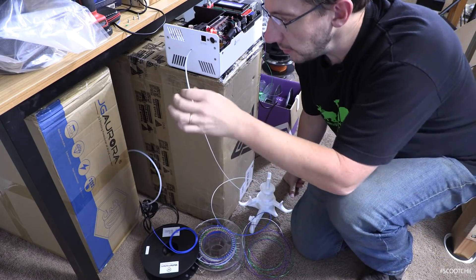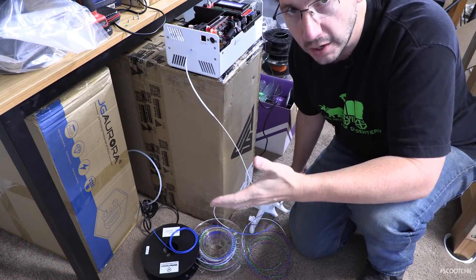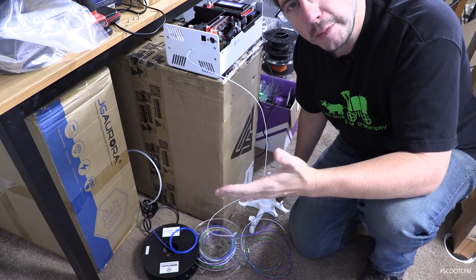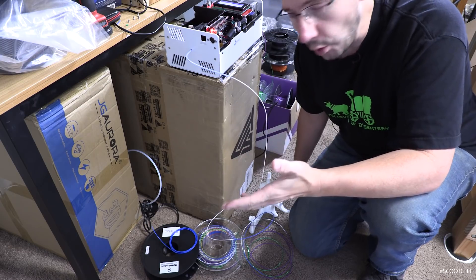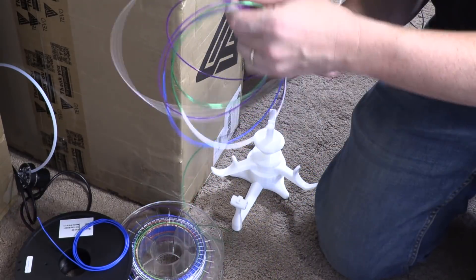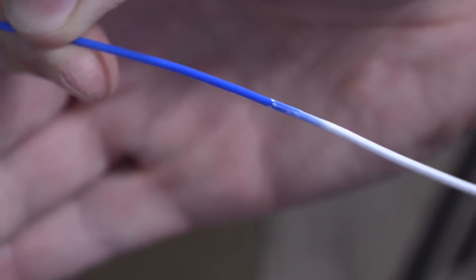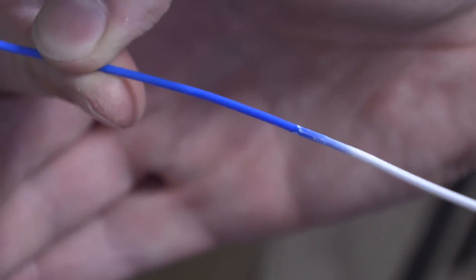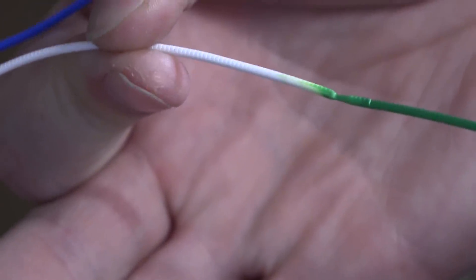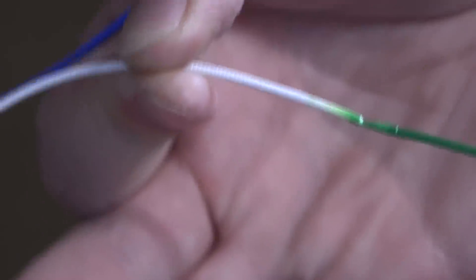Let's take a look at the output. The filament comes out this single tube. When you're using a 3D printer, there's a little magnet that butts up against this wall and tells it whether or not it needs to produce filament, or whether it can coast and use some of the slack. But right now I'm not using it with a printer, so it just comes out this tube. The filament has some memory as to how tightly it was wound on the roll. There's a spliced end right there that's blue to white — that looks really good, really squished together and solidified. You can see that not all splices are perfect; the green pulled away before it cooled enough, leaving a little string. It's still tight enough to hold together, but you wouldn't want to flex it too much.